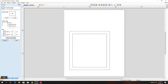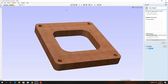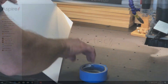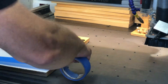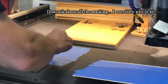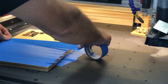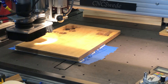This simple design is very easy to draw in the Vectric software. Here I use super glue and masking tape to hold the Baltic birch, and to protect the spoil board I put a piece of thick paper in between. Then it's my CNC's time to make some chips.